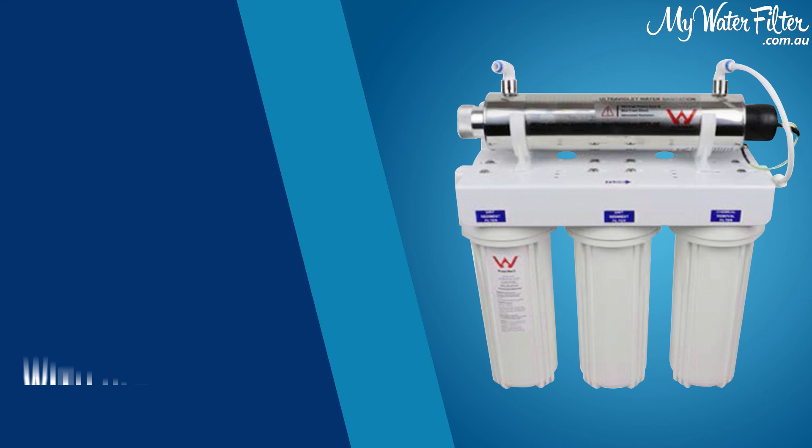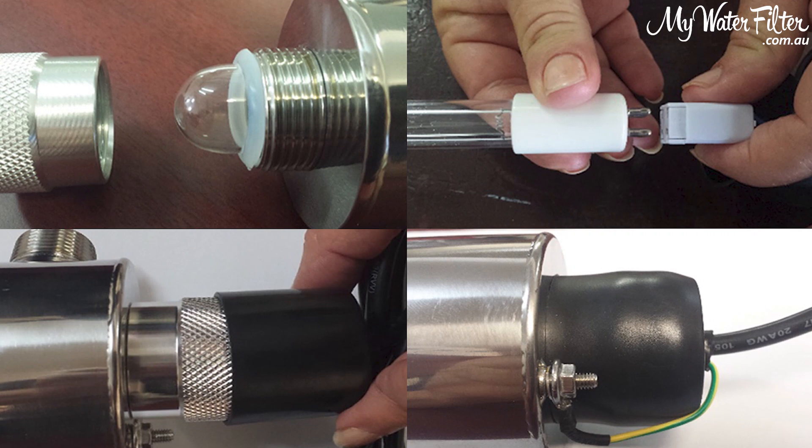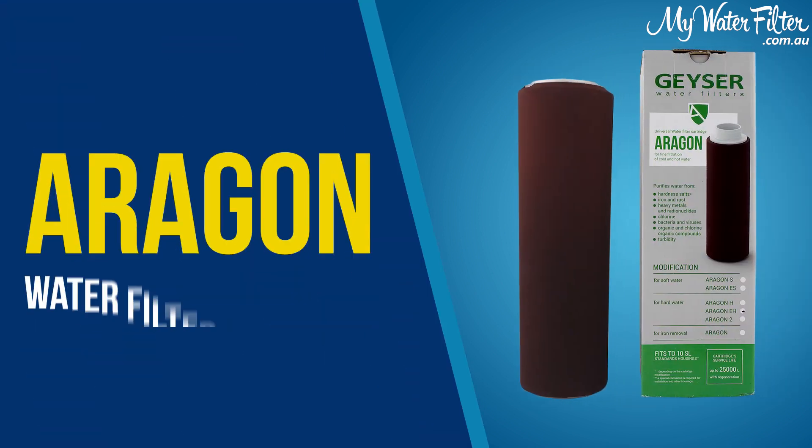There is a range of point-of-use water filters available. Some of them include UV, so you can get a UV sterilizer on a water filter to go under the sink in the kitchen — and they do work. However, there are issues with UV under-sink units: they always have electricity running and generate heat, so the UV housing gets quite hot. When you come back after a period of time for a drink, the water has been heated up by the hot UV housing and globe. Also, if the power goes off, you've got no disinfection. I would much prefer people use a ceramic or even an Aragon filter under their sink — it's filtered right there at the point of use, and they're good to go.